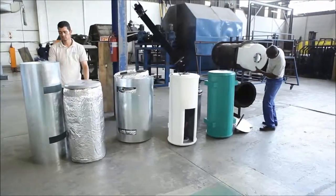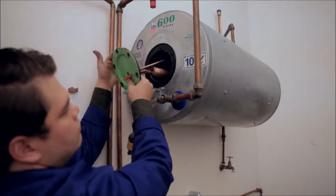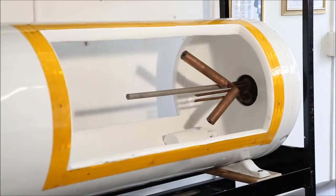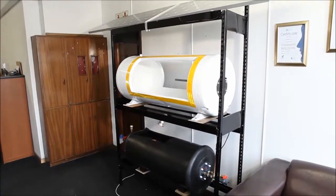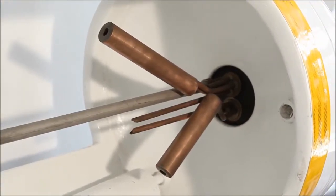The turbo element range can be purchased separately or fitted into our polyethylene geysers in the following combinations: AC or DC. These can be combined as AC-AC or AC-DC depending on the application. For example, in geysers, maximum power saving occurs when the elements are controlled by timers in the AC-AC type, where the lower wattage element is switched during the day and the higher unit is only switched for a short period